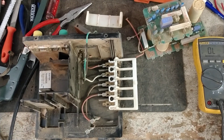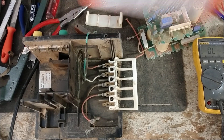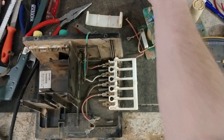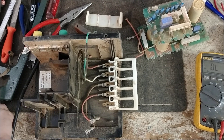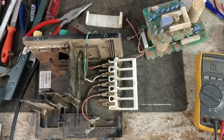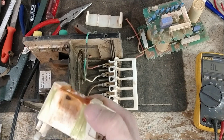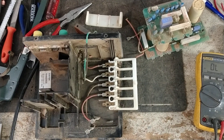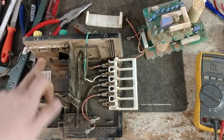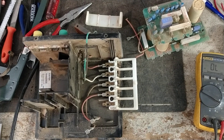This is part 2 of this repair. This is a Gallagher M800, the old style. This repair is basically the same as a Bev3 Gallagher, or even a Gallagher M1500 old style. The 1500 looked just like this one, except it was purple and had two capacitors versus one, with bigger capacitors on the main board. We're replacing a capacitor because it's a little weak, and the transformer, which failed the ground test — you can see a little burn hole in the side. I'll go get the new parts.